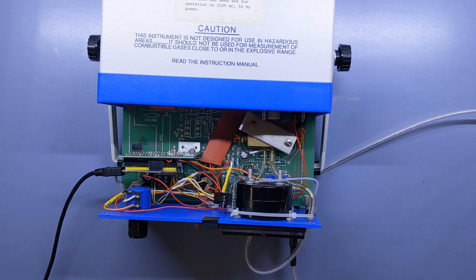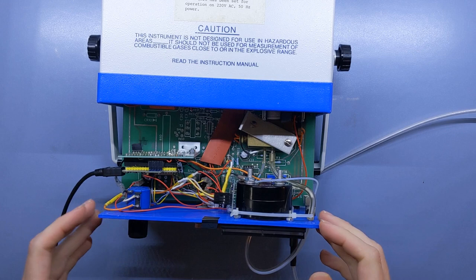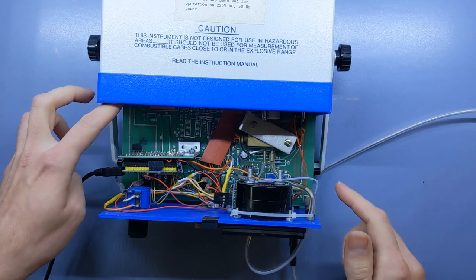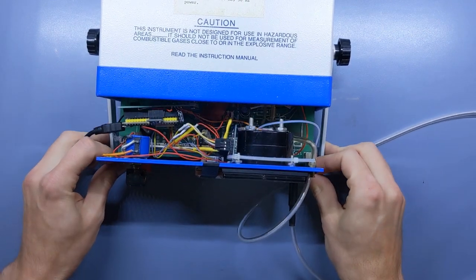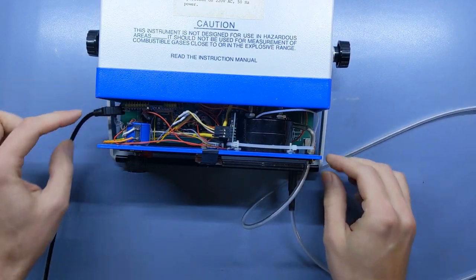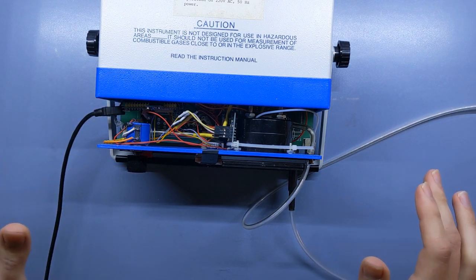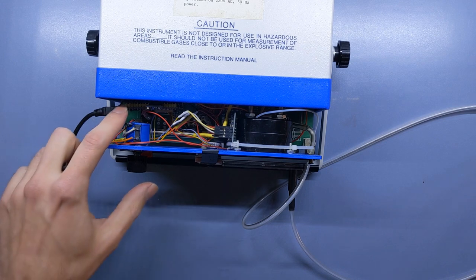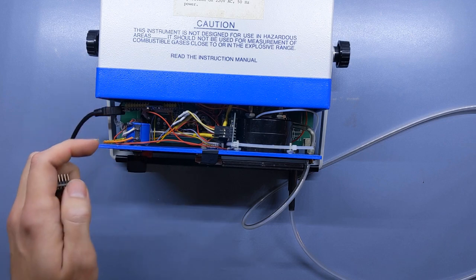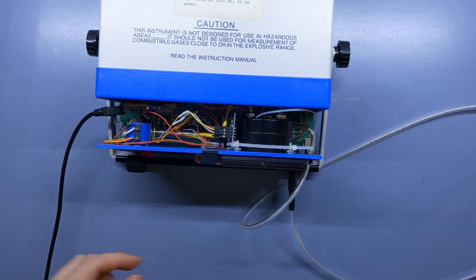After assembly, we need to calibrate the magnetometer again to compensate for the influence of nearby metal, i.e. the case, the pump, the transformer, or the microcontroller. For this, we need to bring the magnetometer to its final position, but then we can't fit the USB cable in anymore, which definitely isn't a design flaw. This means we need to solder some more to use the pins on the microcontroller for programming via a USB to TTL converter. Also, we will add a diffuser for the LED on the front.